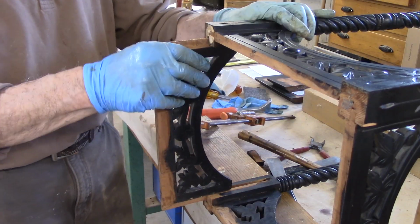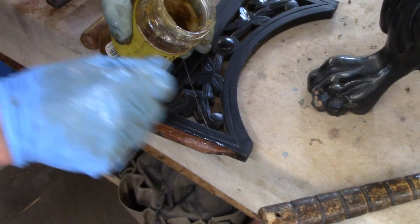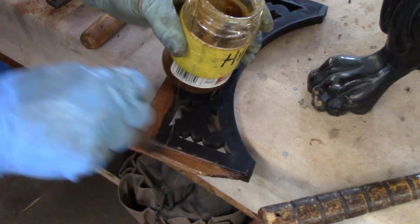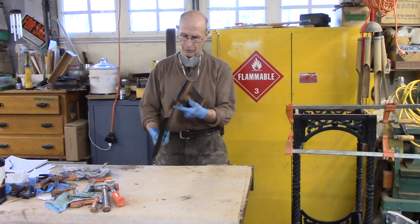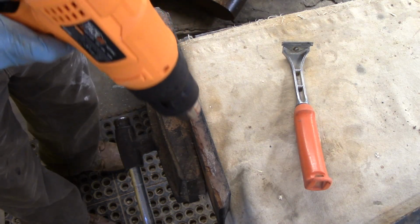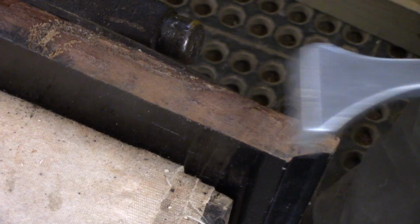So during the process, only one side panel was loose. I'm going to glue that back where it belongs now. This joint, where the top was separated, that joint had been glued previously too. It's filled with glue, so I'll apply a little heat and hopefully it'll come off. I don't want to lose any wood, or if I can help it, I should say.